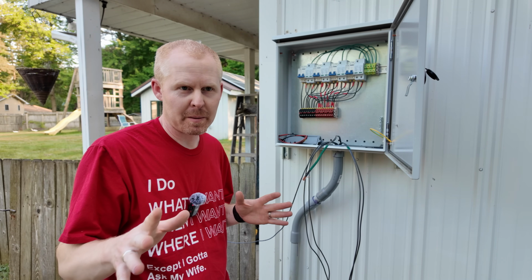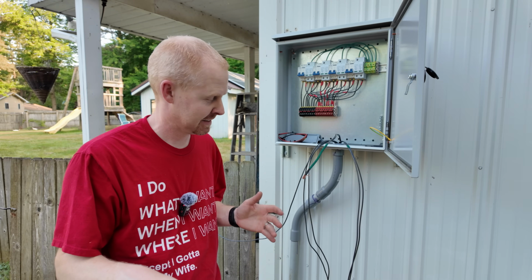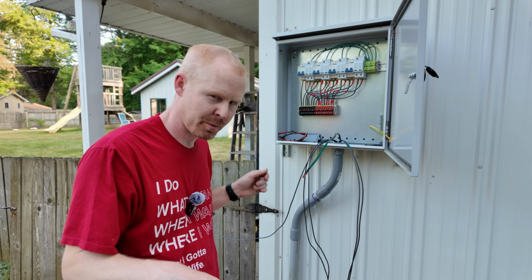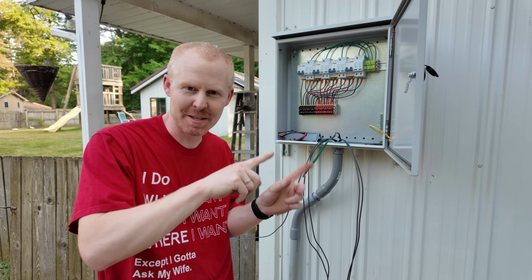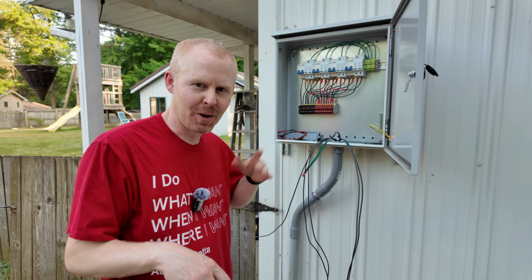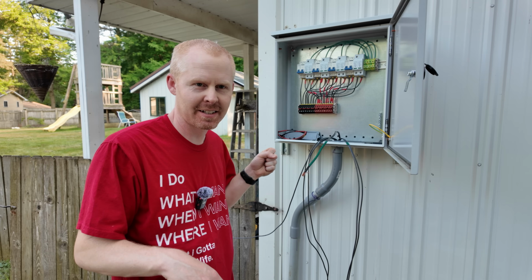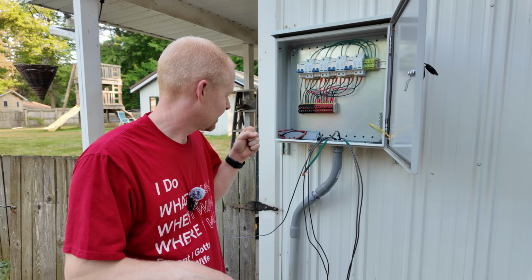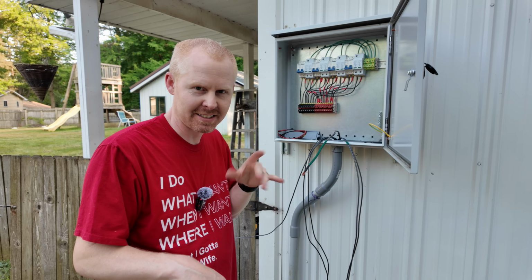We interrupt your programming for this special broadcast announcement. Just kind of a reminder, when you're messing with PV lines, make sure it's disconnected at both ends, the panel and the inverter. Oh, yeah. I don't know which one it was, but I touched it. And it's not the panel side, it's coming from the inverter side. I got a good little zap.